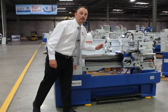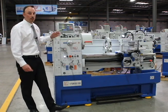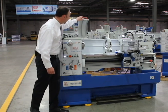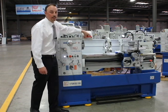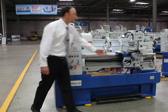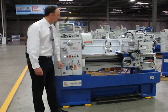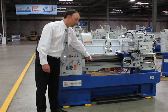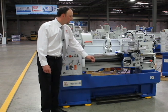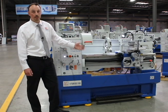All the scales are enclosed in aluminum extruded housings to protect them from chips and dirt. There's a great range of safety features on this machine. The chuck guard is a standard feature and it's safety interlocked, so if it isn't closed the machine won't run. The same applies to the tool post guard — also safety interlocked. And a very nice feature: a cover over the lead screw that not only protects your operator but also protects the machine and the lead screw from chips and dirt.